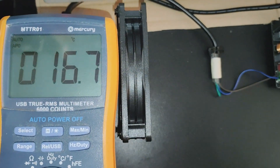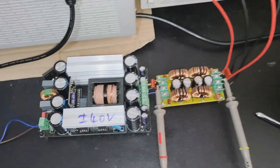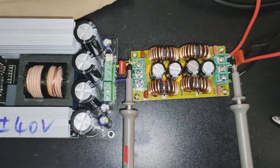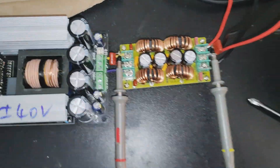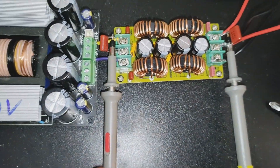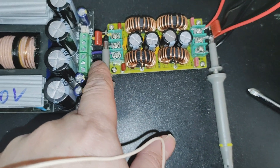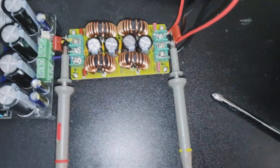Our room temperature is 16.8 degrees centigrade. I already have a switch mode power supply hooked up with the LC — inductor-capacitor — filter. This switch mode power supply has no inductor on the outside. I connected one scope probe directly to the output of the power supply, and another probe connected after the inductor-capacitor filter.